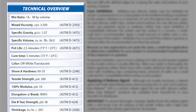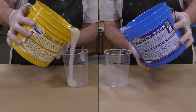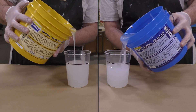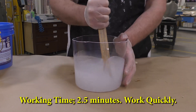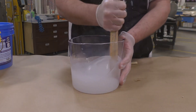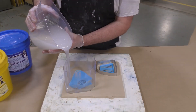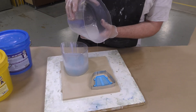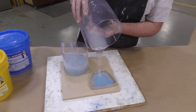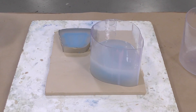It's on a 00-35 shore scale, making it super soft and easy to mold complex pieces. We dispense the material and combine it into a clean mixing container, mixing thoroughly — scrape the sides and scrape the bottom. Work fast but thoroughly. Once the material is mixed, get it quickly into your mold box and pour at the lowest point of the mold box, letting the material find its own level. This pushes air bubbles away from the model surface so they won't be trapped.